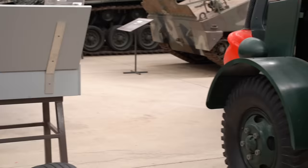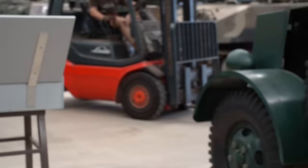So what we're thinking is as the suspension sunk down and gradually got too loose, they took a track link out. So we've had to go through the museum and track down another set of track link that we're lucky got one that's close enough for what we can use, and we're going to fit that now. We need four more connector joiners on the side. We've got some old ones, but they're putting up a fight. We hope to get them off, but we're going to have to play around with them a bit to get them apart.